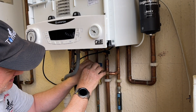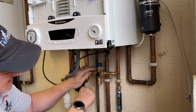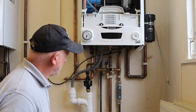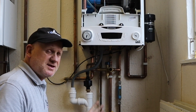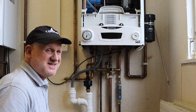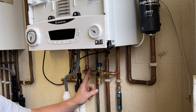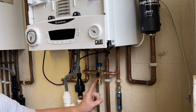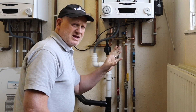The clip worked a treat, and that's it - we've filled the heating system up. Now you might have seen water dribbling out of here, but that's what it's designed to do. This is what's called an RPZ valve - reduced pressure zone valve. So if the pressure is greater on that side than it is on this side, then what it does is it spurts the water out. Let me try and show you that.